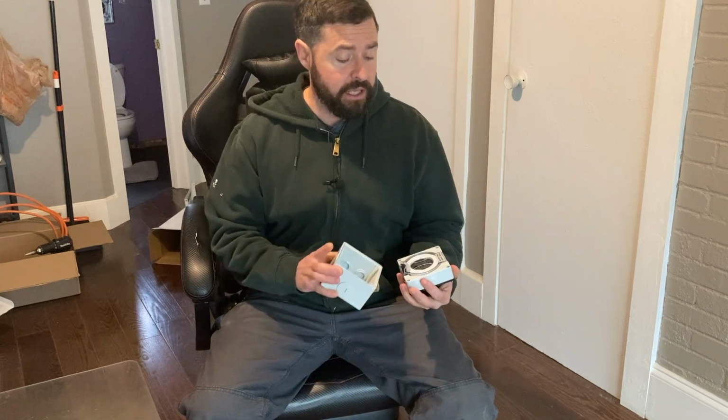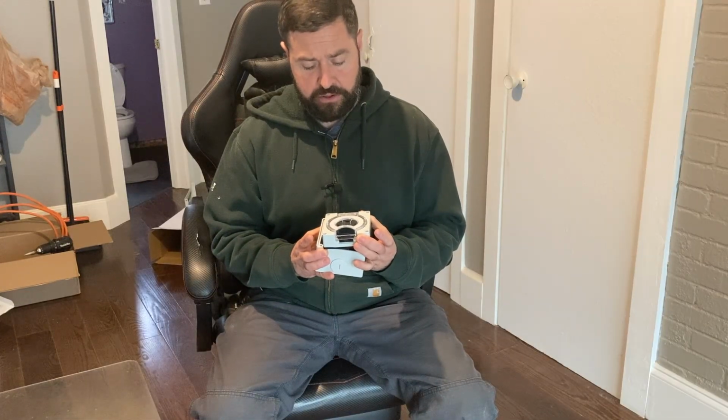On today's episode, we're going to go over wiring up a NEMA 14-30R outlet. This one is outdoor. It is going to provide power from an electrical service to a tiny home. So again, the 14-30R outlet is to provide 30 amps at 240 volts.